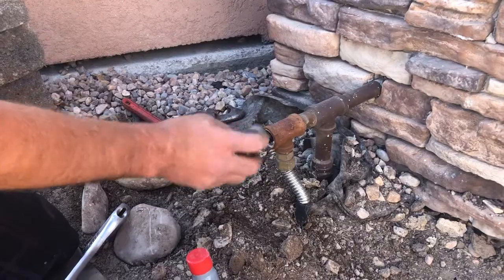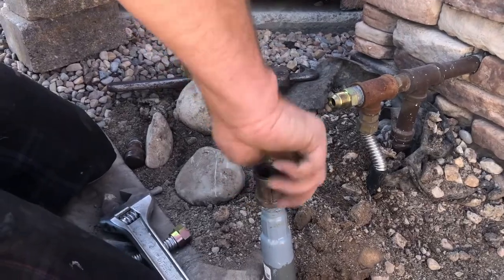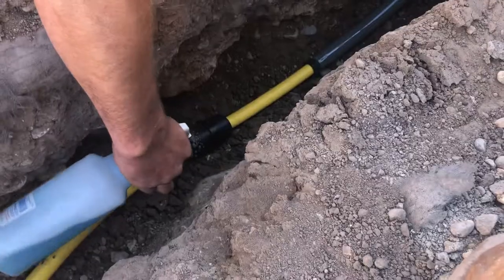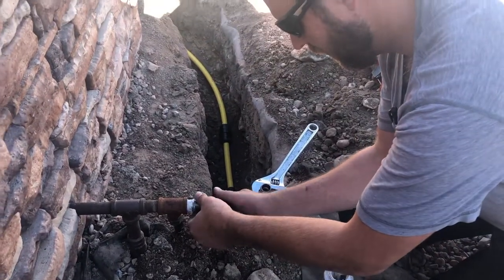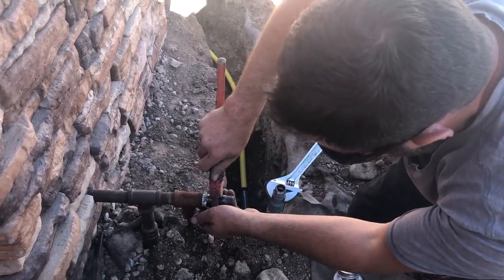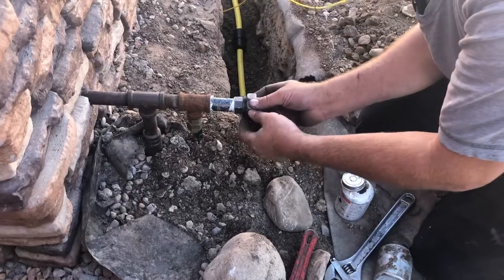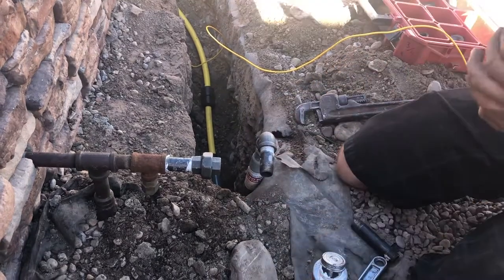Next, we're going to hook up a temporary line — a gas flex that we'll temporarily hook up and cap off the other end. We'll do a pressure test and a leak test, just spraying Windex and checking for any bubbles. We had no leaks, so now we are going to hook it up with hard pipe. All of these black fittings — nipples, elbows — can be found at a local hardware store. This here is a union that lets you connect the pipe in the middle; use plenty of pipe dope to seal it and get them nice and tight.